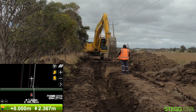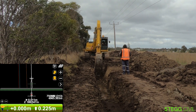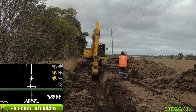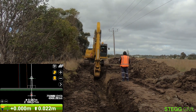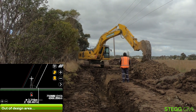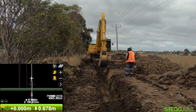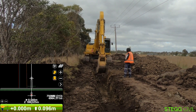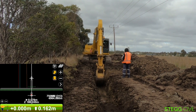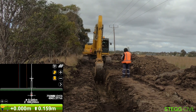He'll be watching that line down the bottom of his screen which has got an arrow left or right showing where he is horizontally, and then the big green bar down the bottom for vertical. Just checking his height now — you saw him pause there for a second — he's getting rid of the bulk of this dirt, making sure he's down to the right depth, and now he's probably going to heel the bottom of that trench to make it nice and neat for the guys to lay some pipe.